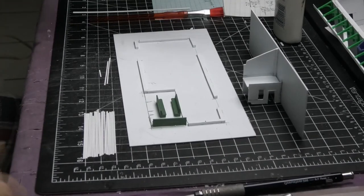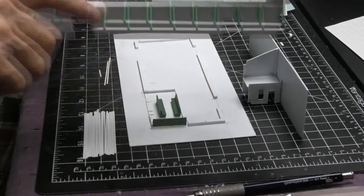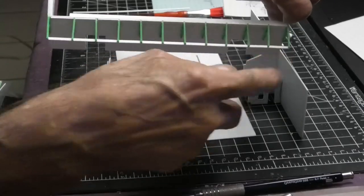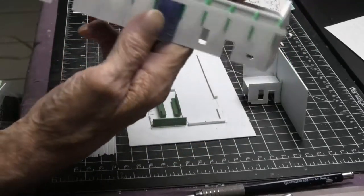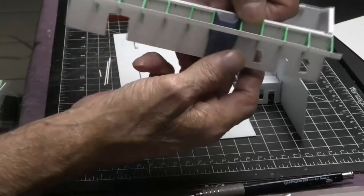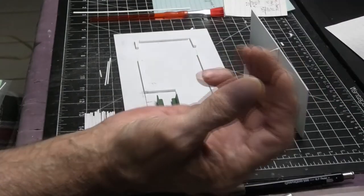Now let me show you some of the progress I've made on this project so far. To keep all of these corbels straight, I put this stringer across here and kept them as straight as possible. And then I took it a step further and put a fascia on there, right here. It's not on there permanent yet. I just wanted to see how it was going to work out. And then the roof will sit right over that fascia and everything will be very nice looking.